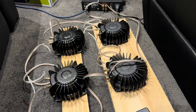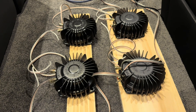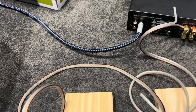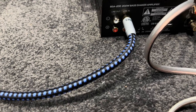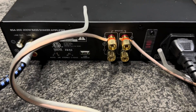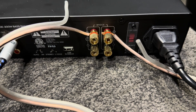From this angle this is the same layout as what I'm going to show you in the diagram. I've got my RCA cable — which is an SVS subwoofer cable — running to the left channel, and then I've got two wires going into the positive connection on the unit so we can get into a bridged mono mode.